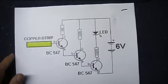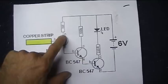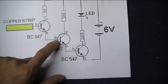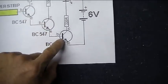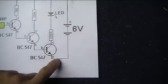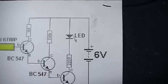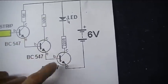Experiment! Try a big piece of aluminum foil, take it outside and see what happens. The input goes to the base of that transistor, the collector through a one-megaohm resistor to six volts. The emitter — the output of the first one — goes to the base of the second one. This collector has a 100k, then it comes out the emitter to the base of the third one. This collector has a 220-ohm resistor, and then the final output — this emitter goes to the negative side of the battery, because it's an NPN. Then there's the LED that lights up once that little signal gets all the way through all three transistors.